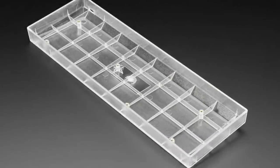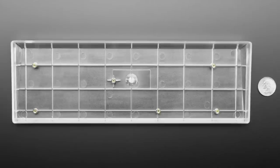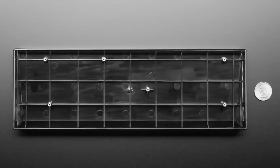All right. Okay. First up, we've got some more keyboard cases. We have the 60% keyboard shells, but let's say you like arrow keys, you want a bigger shell. Like these, called the K68s or JKDK 68s. I don't have CAD files for them. I'm going to try to get them. But you could just measure the mounting holes and use these for designing a PCB for a keyboard.